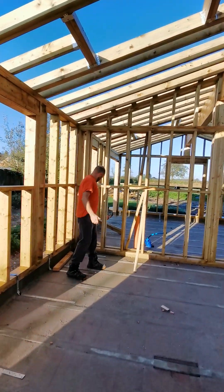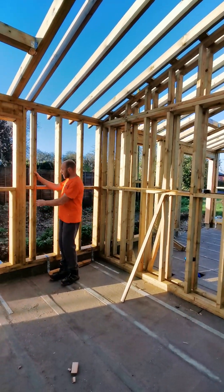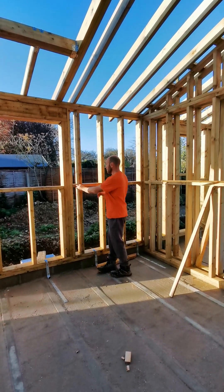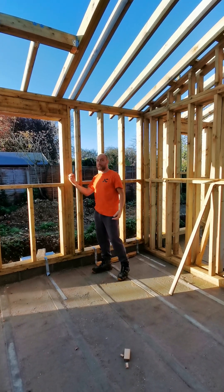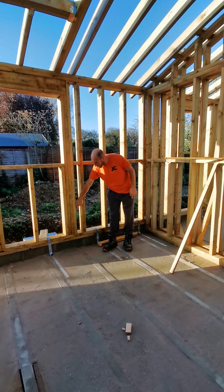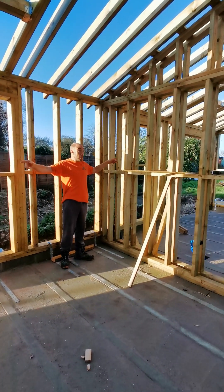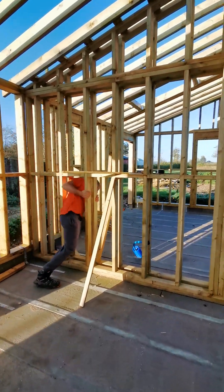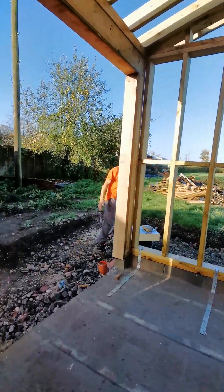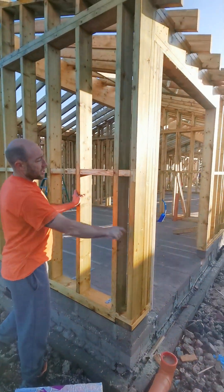Partition walls, toilets — what we've done is we've worked it out for studs in the side, plasterboard, allowing enough for where the window detail is. Also we're going to be ply-ing today, so we're going to make sure that any cold spots where we've got our stud walls, especially in the corners of the building, we will put some insulation in.